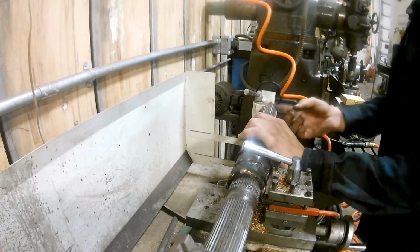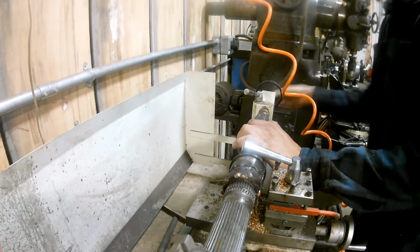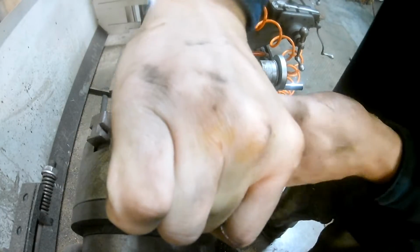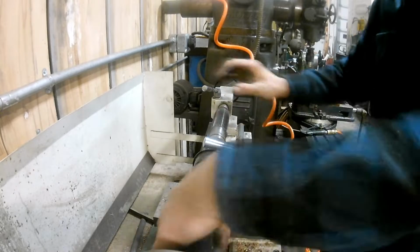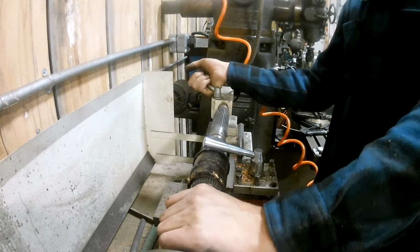As always, just slather a good amount of grease in the pilot hole, because I have a dead center. If you have a live center, you don't have to worry about that. Now we tighten it snug, and turn this side tight. Get good and snug. And down here, you just back her off a smidgen. I usually just judge it by the feel of rolling. Rolls good. Tight, just back it off so it rolls nice and smooth. Tighten it down.